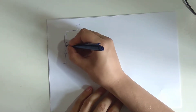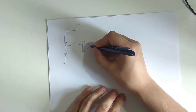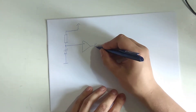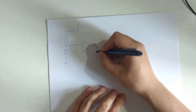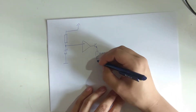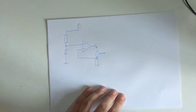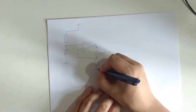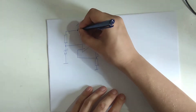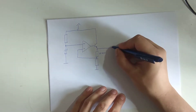After you generate constant voltage, you have an op-amp that drives an NPN transistor, and that goes down to the load, which is the PT100. It also has a sense resistor, and the voltage from this sense resistor goes back to the inverting input of the op-amp, which terminates down to ground. The transistor with its collector goes up, and you would read your PT100 voltage from here - this goes up to the next stage.